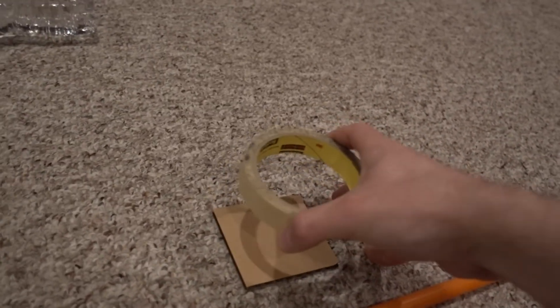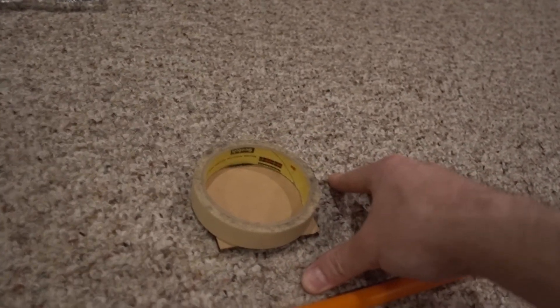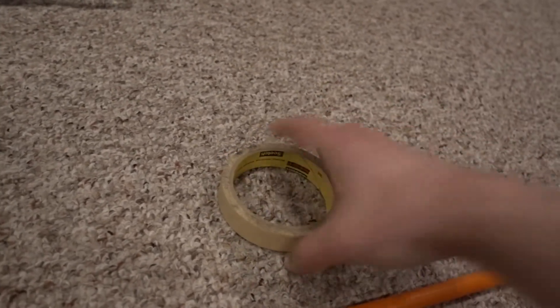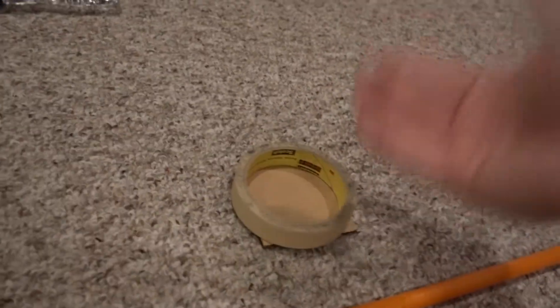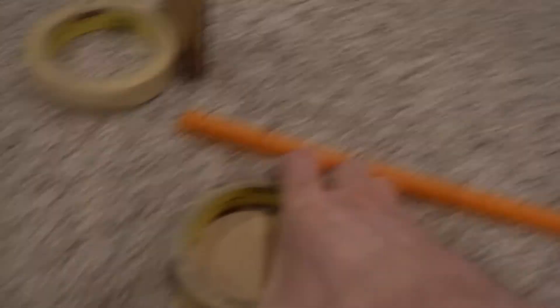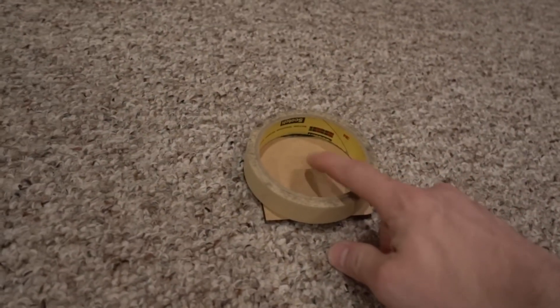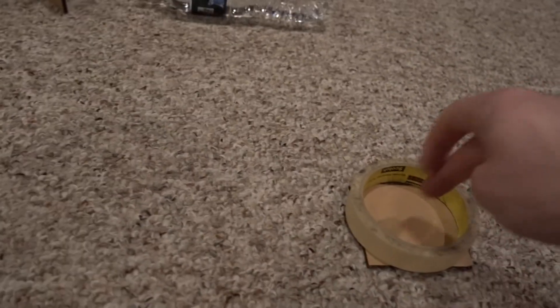The last thing to check is coming out of the nozzle. Put a piece of thermal paper under your nozzle and when you fire it, you expect to see a dot right in the center. If you don't, go back to mirror three and tweak it until you get a centered dot. This is honestly the easiest way to align mirror three rather than putting thermal paper on top of the lens. Then verify in the bottom right corner, bottom left, top left, and top right of your bed that you're always getting that dot in the same exact spot on your thermal paper — confirming that mirrors one and two are properly aligned and mirror three is shooting consistently.